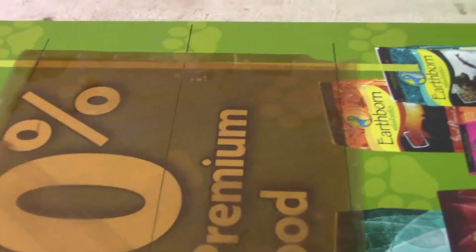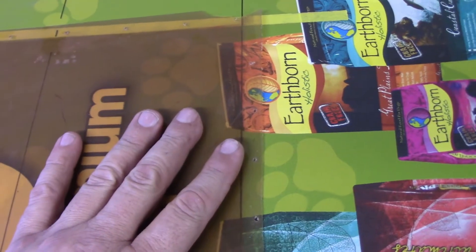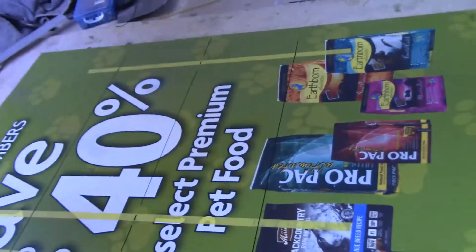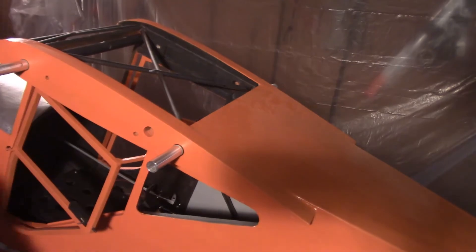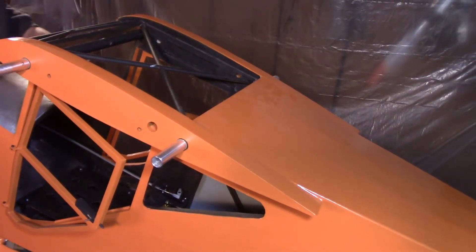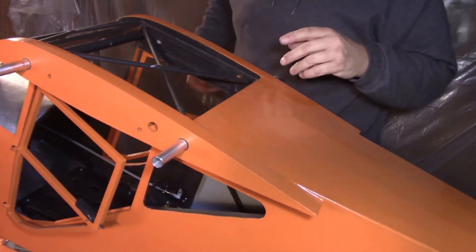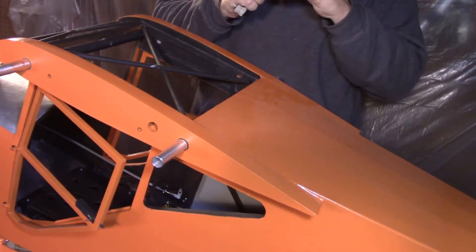If you take the original and line everything up the way it's supposed to be, you'll see that it's off there and off here — so something doesn't seem right. What I did was when I rebuilt the top, it was not straight and I made it as straight as I could. Remember I mentioned it flares out towards the nose of the airplane, so you take a bevel gauge and come on this side of it and slide it down because a square won't work since it flares out. When you flip it over it lines up just as well on the other side, so you know the angle has been split going out to the front — so this is true.